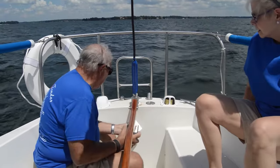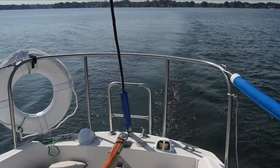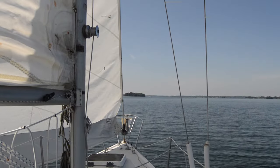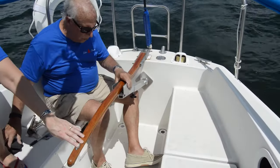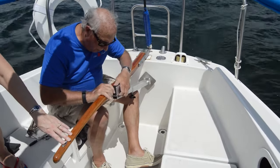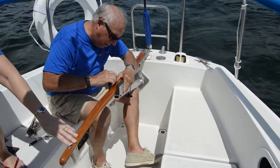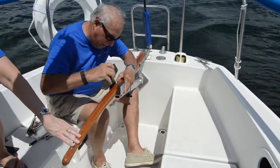Every boat is different. The rudder and a keel are rarely true, so under full power or sail, one person should keep the boat on a true course. The second person takes the tiller tender and positions the tiller in the middle of the saddle or the cradle. Half-inch neoprene shims are provided with each tiller tender kit.